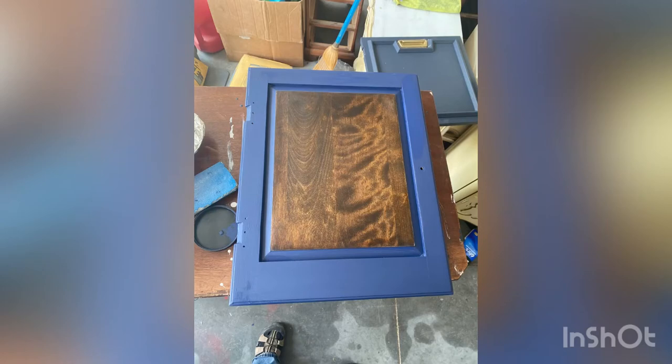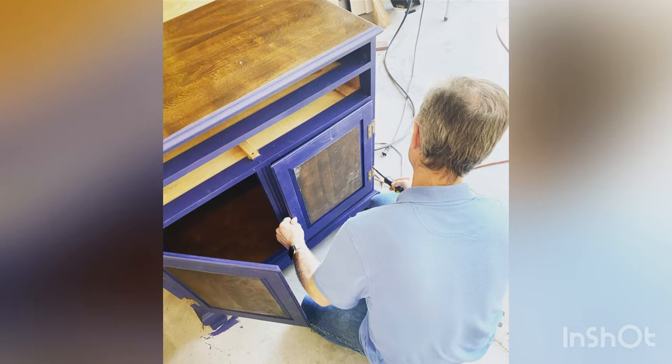All right, here's the finished door, and then I had my husband help put on the doors. Just a side note for you guys, I didn't get this part of the flip videoed, but I did keep the original hardware. I spray painted them with Rust-Oleum's gold and then top coated them, and had my husband actually help me adjust the hinges and everything, as you saw in that picture there. And then I did top coat the wooden parts with Minwax's polyacrylic. And so that wasn't on the camera either.